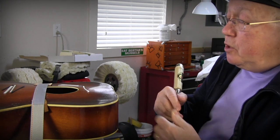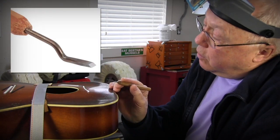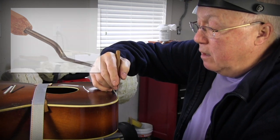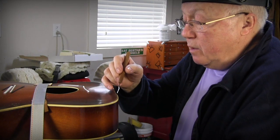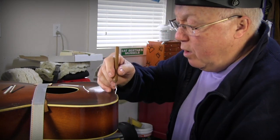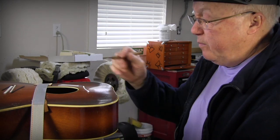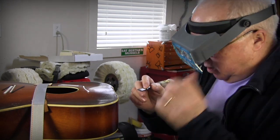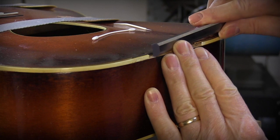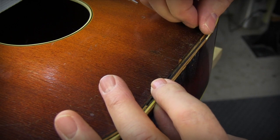At that point I was ready to come into the channels and clean them out. My biggest tool was a micro chisel that I ground really skinny on the belt sander and grinder so I could get in between the binding layers. I'm sticking the binding in in stepped layers — that way the binding holds itself in. The black is inside the white on both edges. There's always a little overlap on every joint so it doesn't just fall out. The ends of my pieces sort of overlap, which helps hold them in.